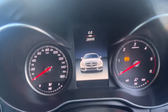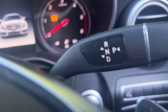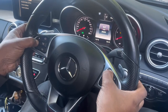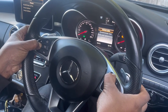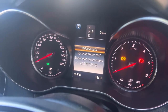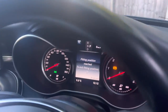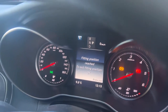I've already done the rear brake pads. Now I'm going to show you how to exit from fitting position. First, turn ignition on. Then again press call and OK together. When I press call and OK, it comes to the main menu again. Scroll down with the button and select brake pad replacement, then press OK.